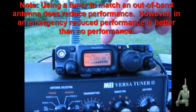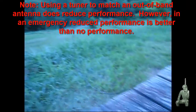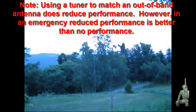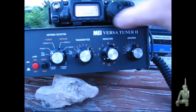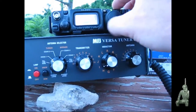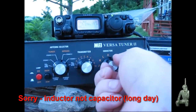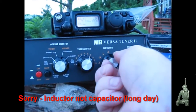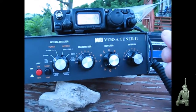We're back. I got the radio set for 7 megahertz frequency, which this antenna clearly is not cut for. We were able to use the tuner — we rotated for max noise, put this in lower sideband, turned this capacitor for max noise, and if you can hear that shift in sound, we then adjusted these two capacitors for max noise.